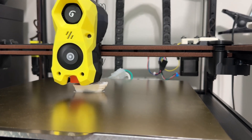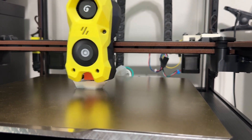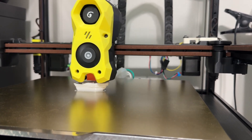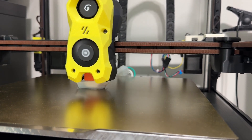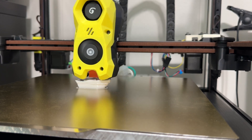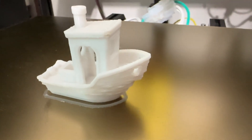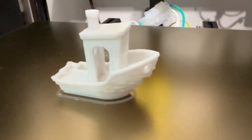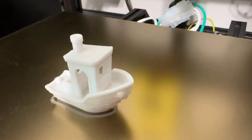Here is a bonus mistake: believing the printer is done once the build is done. These printers are never done. The beauty of building it is the ability to customize and improve it any way you want, but that also means you are responsible for tuning the changes and learning what works and what doesn't. I spent weeks on test prints just to figure out calibration and find it quite interesting — but to someone else, this can be aggravating if they just want plug and play.